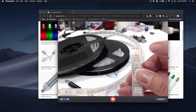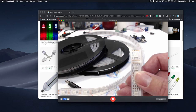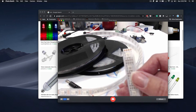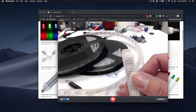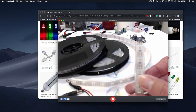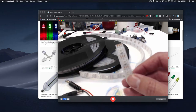This other type has another pin — we still have the ground, the voltage at 5 volts, a data in, and then an additional pin for clock. These are going to be much more controllable and way more advanced, because you not only have to control the data but also the timing. Arduinos can do this too, but it's kind of annoying. Almost everything I deal with is three-pin, so I mainly use those. If you look online, they're also called NeoPixels.